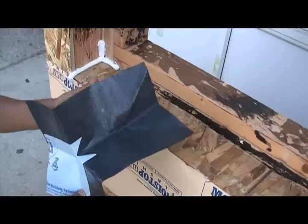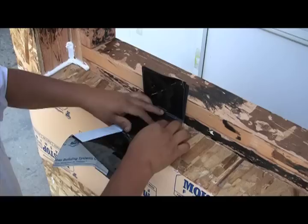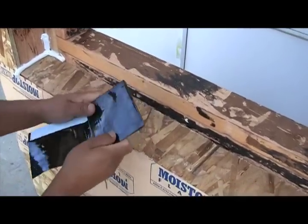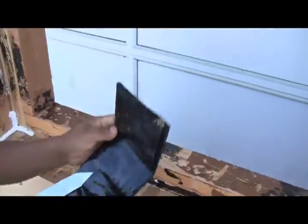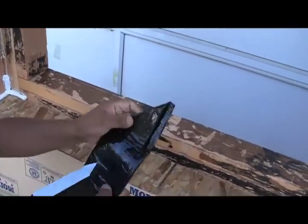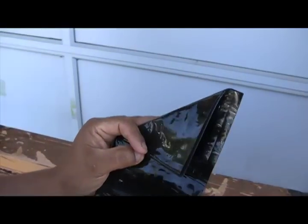This is a GS-108A. This procedure has been value engineered so that only a GS-108A is used in this assembly — we have eliminated the B pieces to help people save money. It is important, though, if you are going to do this, that you understand the fold. The first step is to fold for depth, and then you fold — some people call it a pig's ear — at a 45 degree angle to achieve your inside corner. Fold it just like you see here.